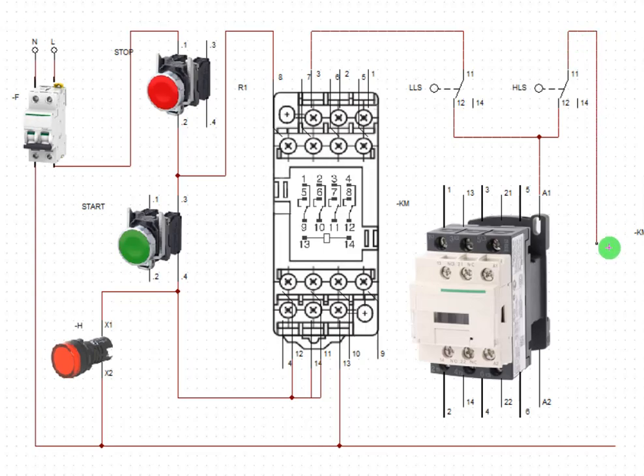When this one comes out, it's coming to terminal 14. Remember that terminal 14 and 13 are the contacts we use to latch. In the same vein, we're going to use them to latch. Then the remaining one, 13, where is 13 coming from? Take care, please. 13 is coming from here. We're taking 13 from here. From here we feed 13, then from here we feed 14. So that is the latching of this. I hope it's clear.